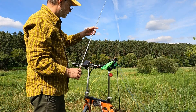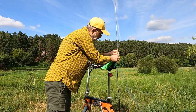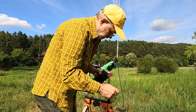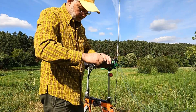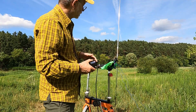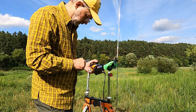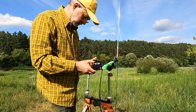That Italian report was 941 miles away at just 1 dB SNR. Now let's quickly relocate the antenna to my bicycle setup and repeat the same procedure. I disconnected the single counterpoise, connected the antenna in the different location, and retuned — getting 1.0:1, very nice — same 5 watts.